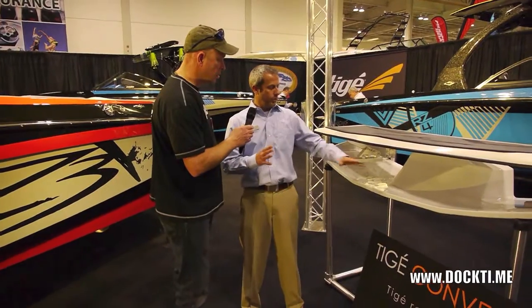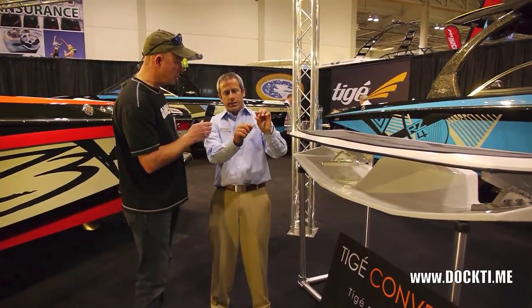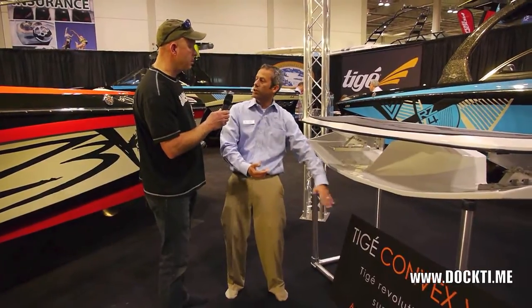When you're not surfing and just want to go cruising around — that's a great question. Because the convex VX continues the convex shape, it comes back up and out of the water, and its initiation point against the hull is recessed upward by about a centimeter. As soon as you get the boat on plane, the convex VX actually doesn't touch the water at all — it's simply hanging in the air space between your platform and the water surface. So there's absolutely no effect. I was driving one myself in Texas two weeks ago — I threw the boat into corners and tried to put it sideways into a wake to see if I could feel it. I could tell no difference whether the convex VX was on the boat or not. Exactly the same as a normal driving boat.